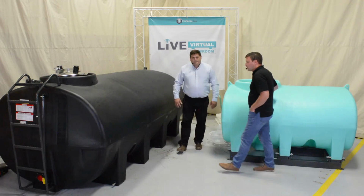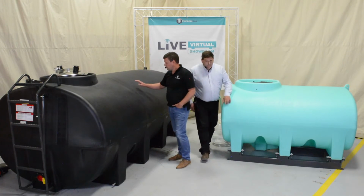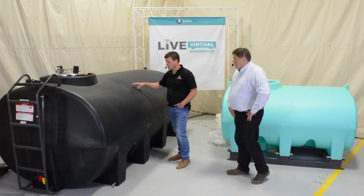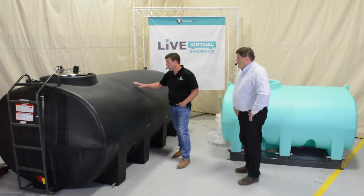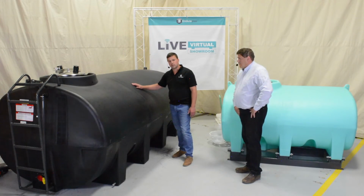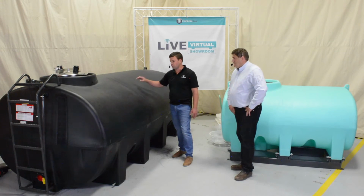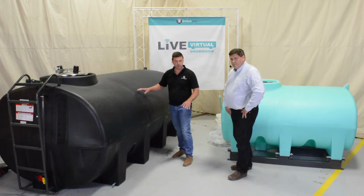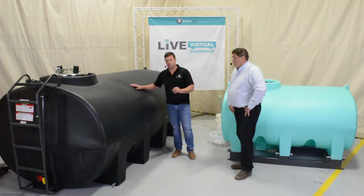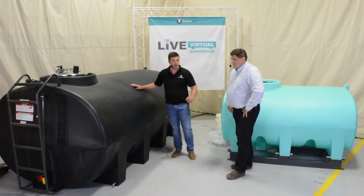So that's a good point, Doug, and thanks for that. So algae has to have sunlight to grow. The only way for algae to grow on water is if the sun can directly contact it. So with the black tank, we make these a solid color, so if you go inside the tank and shut the lid, it's complete darkness, with no light shining through at all. So that prevents any algae growth. And as Doug says, with that green film that gets in there, you're just putting yourself at risk of getting that through your sprayer nozzles and plugging things up.